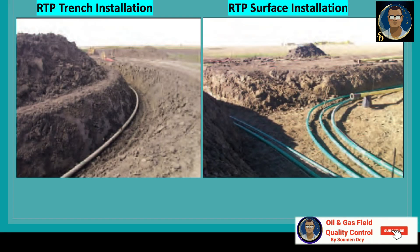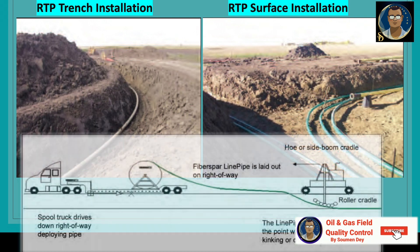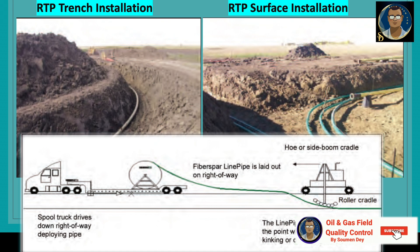There are two types of stationary spool installation: surface installation and buried installation. The buried method is the normal and preferred installation method for areas with soil that is not excessively rocky. The spool and spooling frames serve as an anchor point, and the RTP is deployed by pulling it from the stationary spool. For surface or buried lines, a truck, backhoe, or other piece of construction equipment is used to pull the pipe into the trench. A calibrated shear loop is used to attach the end of the pipe to the pulling equipment.